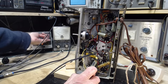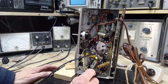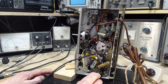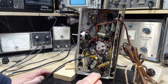I did warn you about that. Don't pay attention to what I'm saying. Cathode voltage showing positive is the actual bias reading. Here we are. I'm on the 15 volt scale, and we're about -5. Okay, not nearly as bad as I thought.